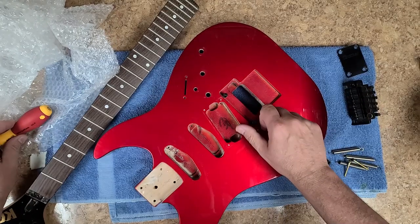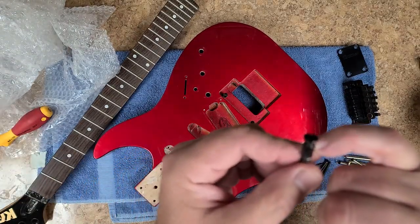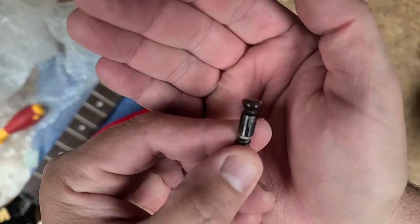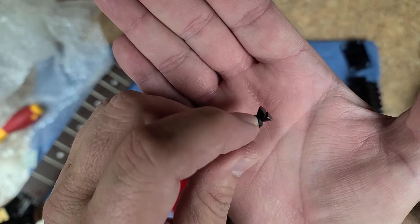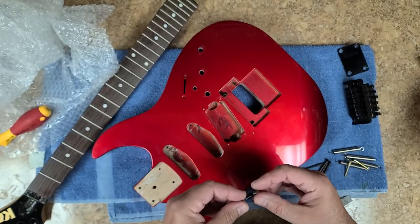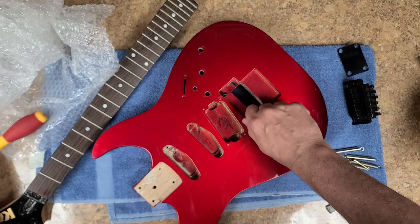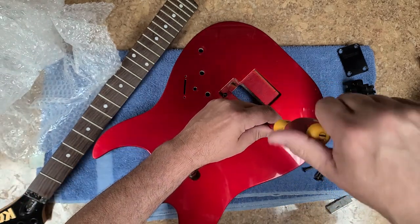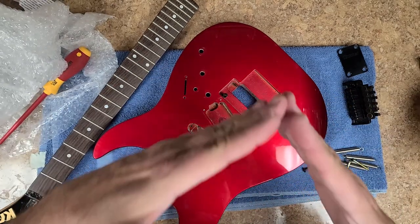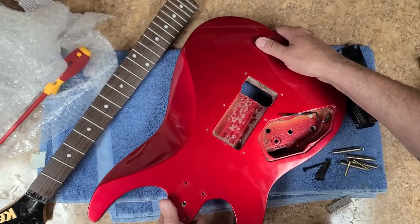I can't thread them by hand — I do have to work on a little bit of the inside of there. There is a little bit of a ring, not much of one, but there is a little bit of a ring. What I need to do is file that so it's got a nice V inside there to where the blades will touch down on that really good.